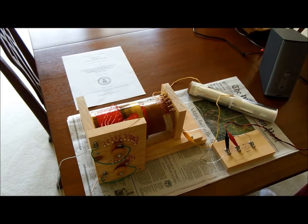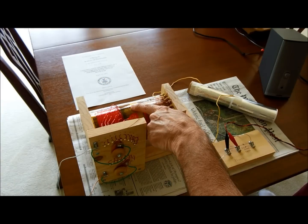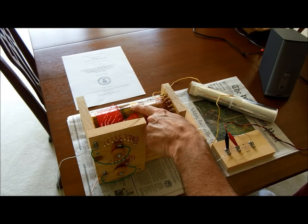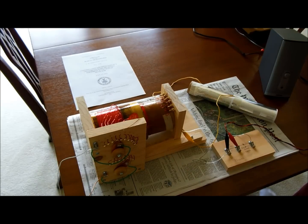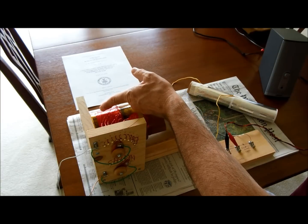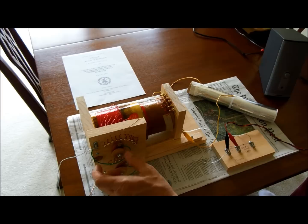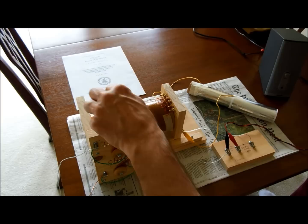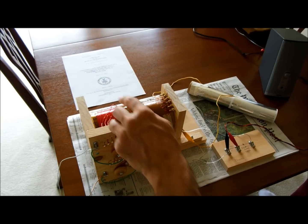The basic parts of the radio: there are two coils. This coil is wound on an oatmeal box, and this second coil is wound on a salt box. The circular describes how many turns to put on each coil. There are a lot of taps on these coils so that by turning these knobs, you can adjust how many of the coils you are using, because these little brass screws are connected to the taps.